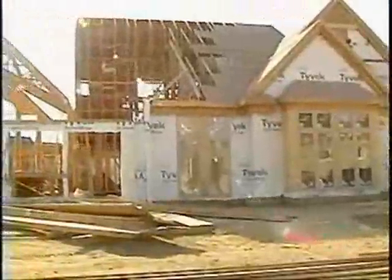What are your recommendations regarding tilt wall construction? When you frame the wall on the deck, you have to be sure that the builder's crew leaves enough Tyvek — approximately 12 inches or so — to overlap the rim joist and onto the foundation when that wall is tilted up.